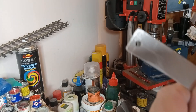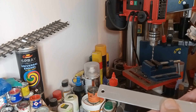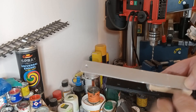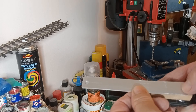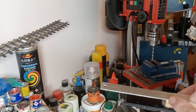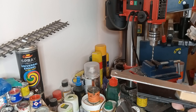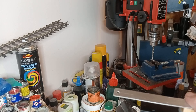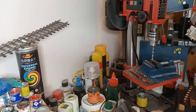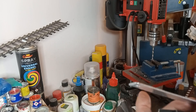When I fit the bogey to the front, if that bit's wrong I can adjust it by moving it up and down the wood at the back — I'll drill a couple of holes in the ally so I can move it to get the spacing correct at the front. Once that's done I can put some glue underneath: Araldite or super glue. Then I'll pop through and use perhaps a wood screw to fix it down. You've still got a little bit you can bend very slightly if the bogey isn't down on the rails enough or is too high — so there's a little leeway to adjust.